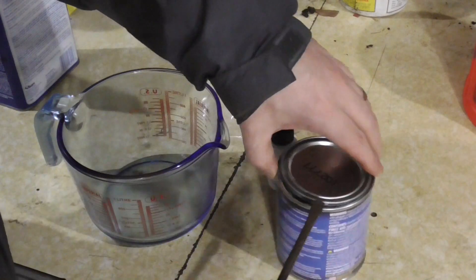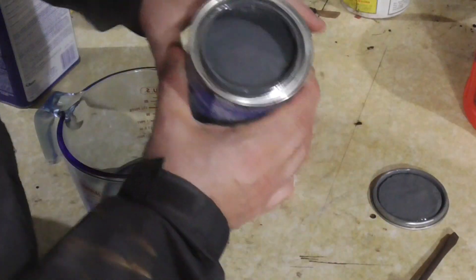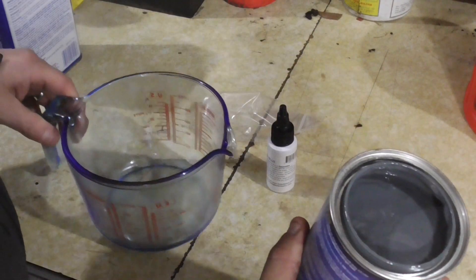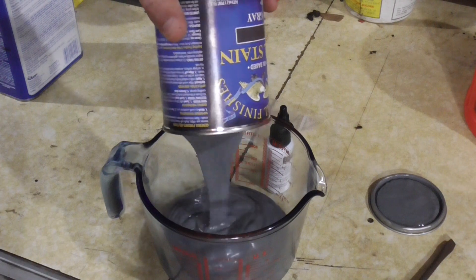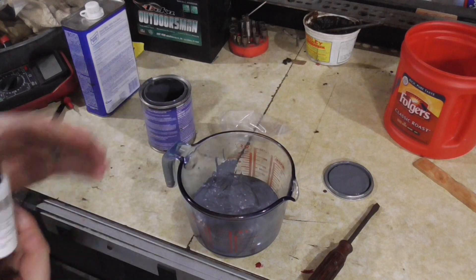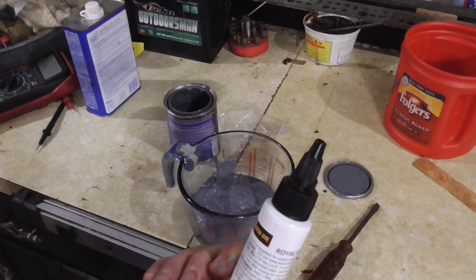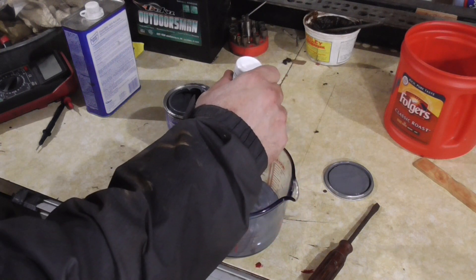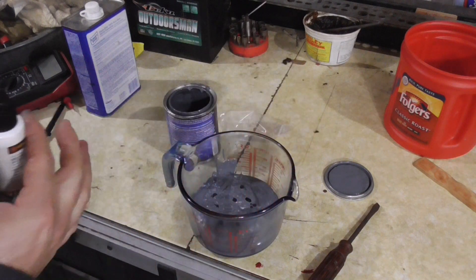What we're going to do is thin it a little bit and add a little bit of the blue dye. You can see this is a nice gray color. The problem with the gel is that it's a gel, so it's a little hard to tint because you've got to thin it a little bit. I have one pint here — a pint is like 16 ounces — and I'm putting in about 10 drops of the dye. The nice thing about this stuff is you can count the drops: one, two, three, four, five, six, seven, eight, nine, ten.